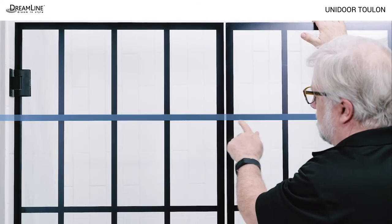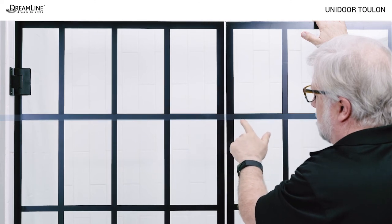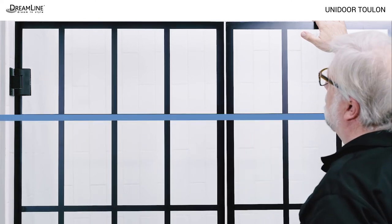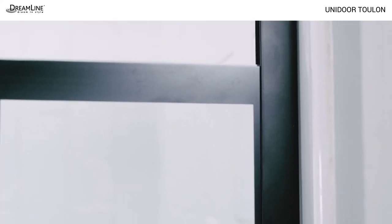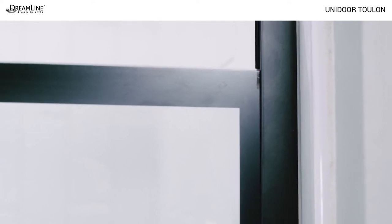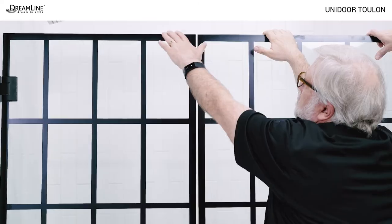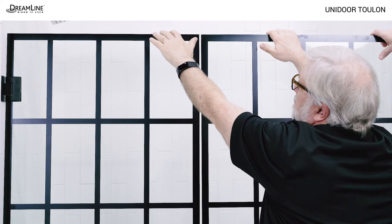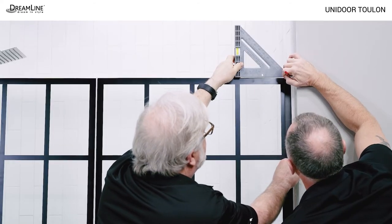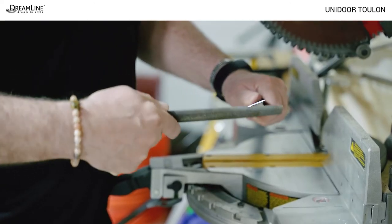The patterns on the door and the panel should line up. If not, check that the panel glass is right side up and that the door glass is at the right height. The maximum adjustment for shifting the panel glass out of the vertical U-channel is half an inch — do not move the panel glass out past the mark made earlier on the glass. Be sure the tops of the panel and the door are evenly aligned. Mark the vertical U-channel at the top edge of the glass to get the cut line. Cut both U-channels at the marks and file off any burrs.